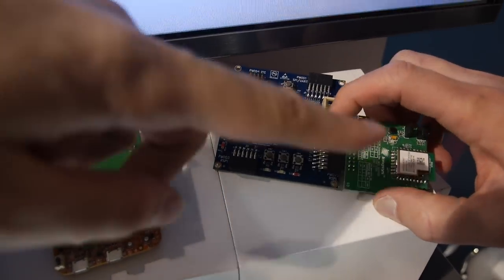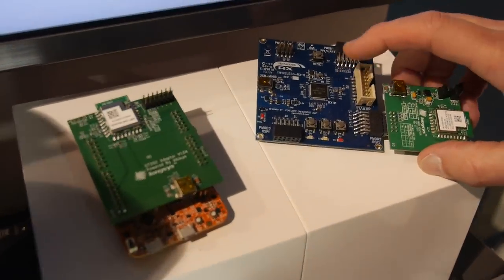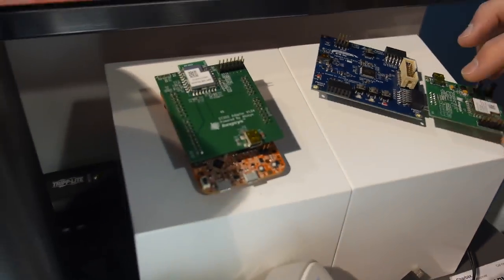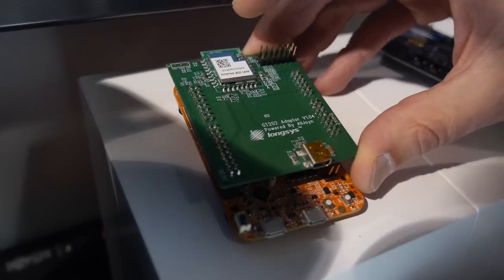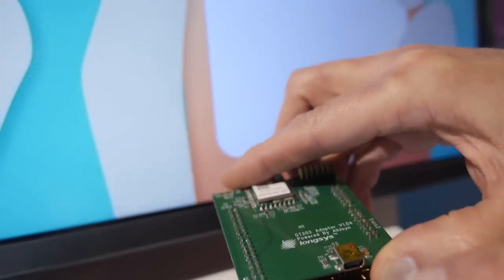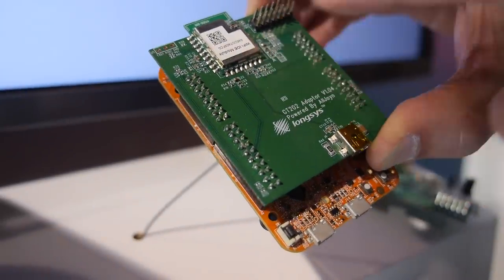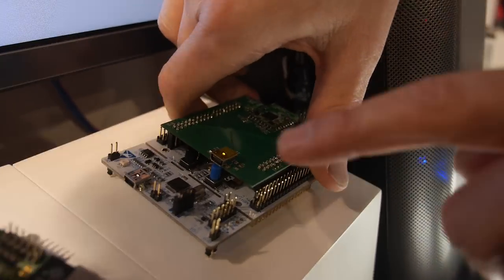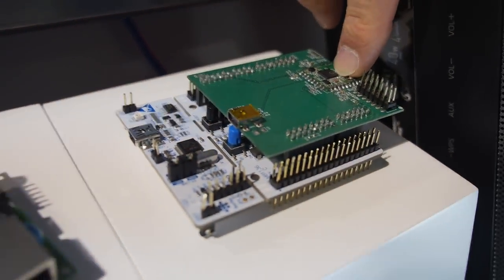So what kind of microcontroller do they have here? It's their RX111 platform. The Wi-Fi is over here — this is a 4002 from Qualcomm, paired with the Renesas microcontroller. This is the Freescale Freedom board; again the GT202 is the reference design, paired with the Freescale microcontroller K22 and the Qualcomm 4002 Wi-Fi chip. And then another GT202 reference design, this time with the STMicro microcontroller, paired with the 4002.